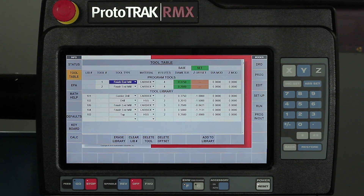The first one is your base tool. The machine comes with a tool setting device so I can set each one of my tools up for the offsets, whether I want to use the back of the vise or a tool setter itself — one, two, three block, whatever you prefer. The important thing is that we use the same device in the same spot for every tool so that when we put them in the library they will be correct when we bring them back out.